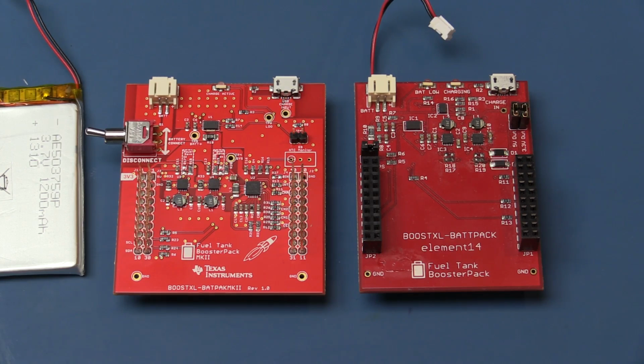As I said, one is for charging the battery, and one is for actually monitoring the battery condition, so it can tell you how much charge is left in the battery and things like that, and how long it'll take to finish charging it. It'll even estimate how long you can run the battery for before you run out of juice, because it actually keeps track of the volts and the current feeding in and out of the battery between its programmed supply ranges.